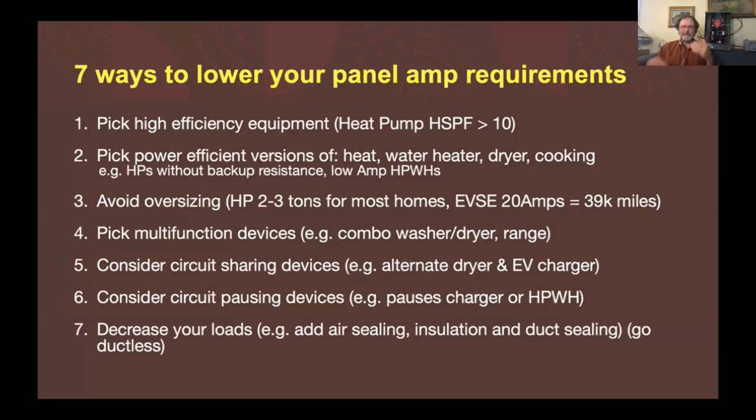It is so tempting. And there's a split incentive where the contractor wants to oversize the unit for two reasons. One is they're marking up the unit, and so the bigger the unit they can sell you, the more markup they can get. And the other is they're thinking you won't know how to run it and you might complain if it's slower than a rocket gas heating system on recovery. And so they're wanting to decrease the possibility that they get called because you are unsatisfied because you're trying to use deep nighttime setbacks and then catch up in 1 hour in the morning. These heat pumps maybe need 2 or 3 hours to catch up with your morning targets. So don't set them down so low at night.